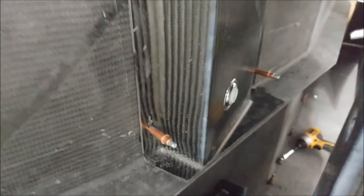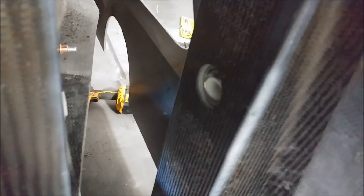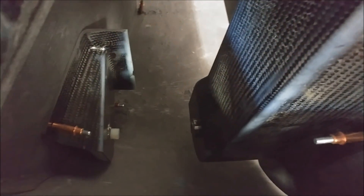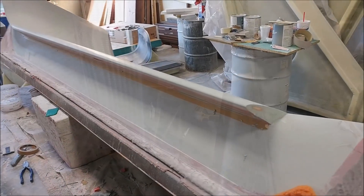Back in place now — the bushing has been put in there. These are spherical bushings so they have a little bit of movement in them. The one on the other side is in as well, and the lower bracket has been positioned and Clecoed into place with its bushing in there, so basically all those brackets are sorted out now. We can pull apart the rear pressure bulkhead and bond all those things into place.